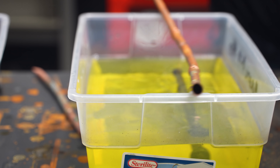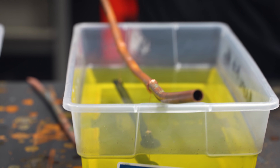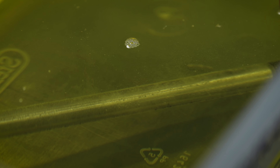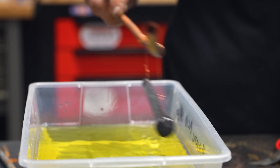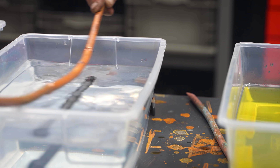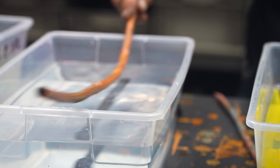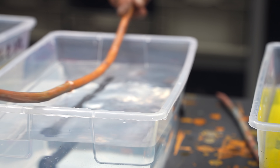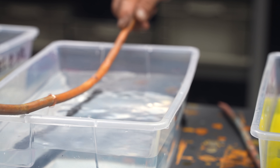Now, if this bolt still had any type of plating on it or rust, the muriatic acid would fizz and pull it off. I'm sure John will have a takeaway of some that we've done there. As you continue to do this, you're going to start putting more chemical into your fresh water, so just think about the dilution factor there.